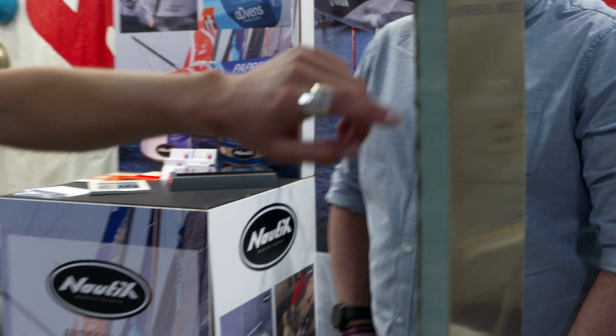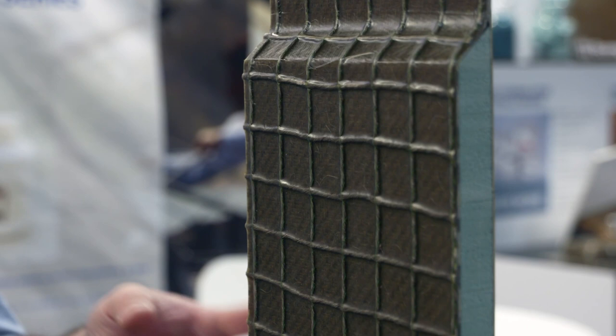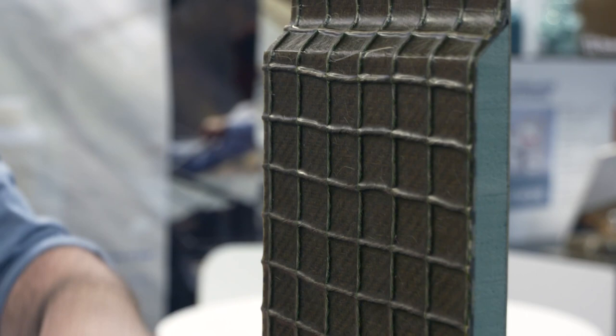If we look at the core and the mesh behind the panel — this panel is made with infusion techniques, which typically involve quite a lot of plastic transfer meshes and waste. This is a product called Power Ribs from B-Comp, which is used to transfer resin across the back of the panel but stays in the panel, adding to its overall stiffness. So those are my top five picks — there's obviously so much more here at the show, come and check it out for yourself next year.